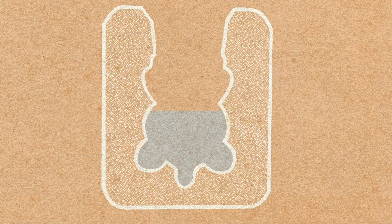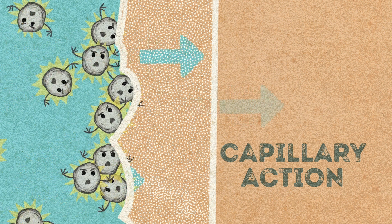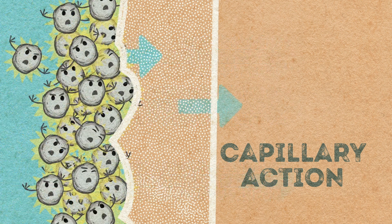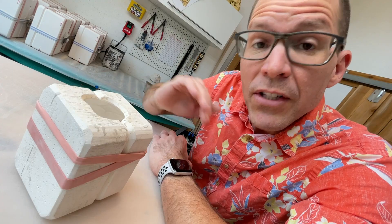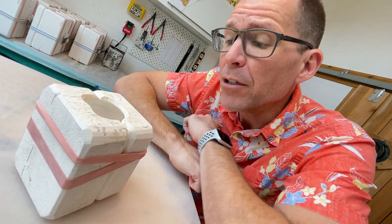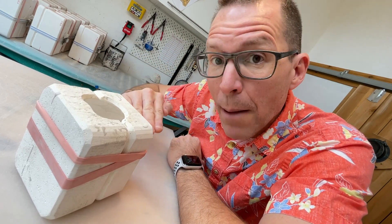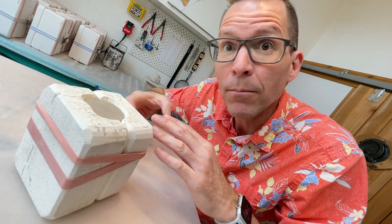We're counting on that porosity to wick the water out of the slip using capillary action. Like a giant paper towel, the plaster mold sucks the water out of the slip — that's the capillary action. It replaces gravity in this sedimentary process, pulling all the particles of clay against the mold walls. As time passes, more clay particles are packed against the wall and the walls get thicker. The longer this slip sits inside the mold, the thicker the wall will be. I'm going to give this about 45 minutes — and you'll see the level of slip will actually drop, which is why we have the well on the top.